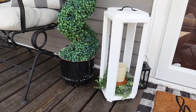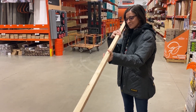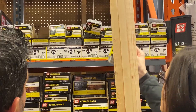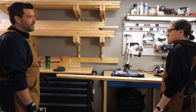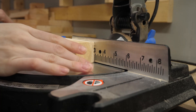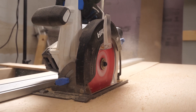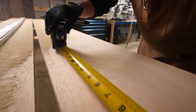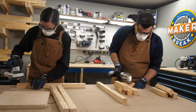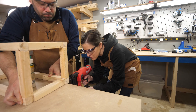This week we made a patio lantern inspired by the Daily DIYer. We started by looking for the straightest 2x2s we could find. After we were happy with our selection, we grabbed some nails, little feet, and headed back to the shop. Using our miter saw, we cut the 2x2s down to size — four pieces at 22 inches long and eight pieces at 8 inches long. While Sarah did that, I was utilizing some leftover plywood to cut a 12x12 piece for the base. Before long we had all our pieces and started sanding. As we assembled the frame, we used a little bit of glue and a brad nailer to hold it together.